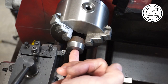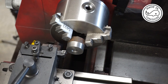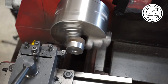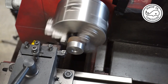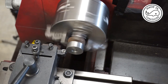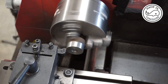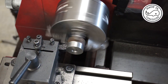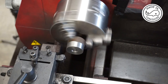Off-camera I've just tapped 5BA and now I'm turning the outside diameter to 10-thou oversize. I'm running at 300 RPM and using the fine feed on the carriage. I'll keep on cutting in 10-thou increments until I'm just 10-thou oversize.